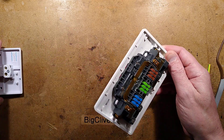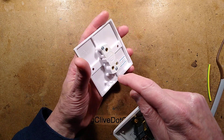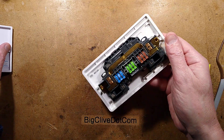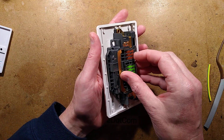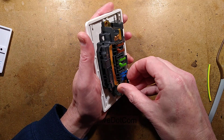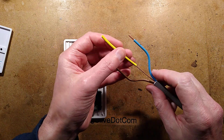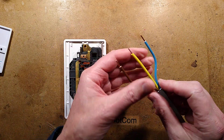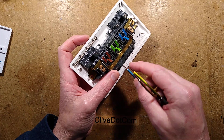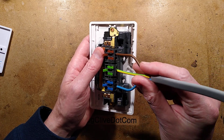What makes it special is that instead of the traditional terminals — where you've got recessed little brass terminals with a screw going in from the side, that you strip the wire and either just put it straight down or fold it to fill up the terminal and then tighten the screw — instead of that, they have these Wago-style pop-up terminals. To terminate it, all you theoretically have to do is get your twin and earth, formed to the perfect shape and size, strip it so the wires are the correct length according to the gauge, and then pop the wires in one at a time — although I'm just going to stuff the whole lot in at once.